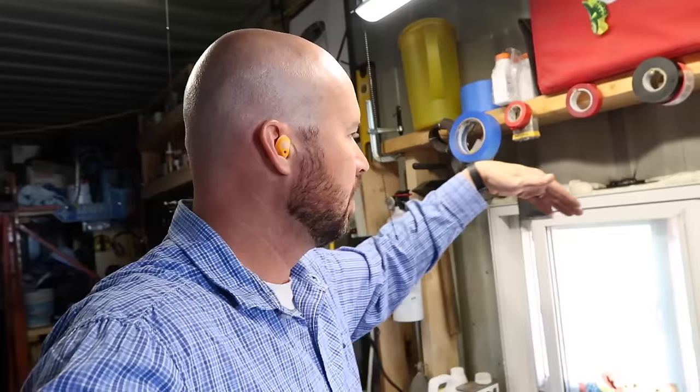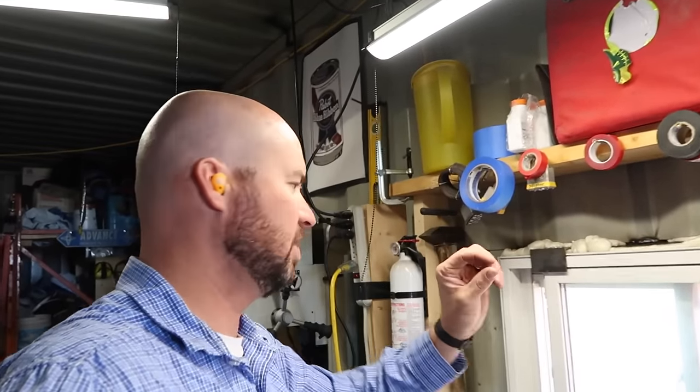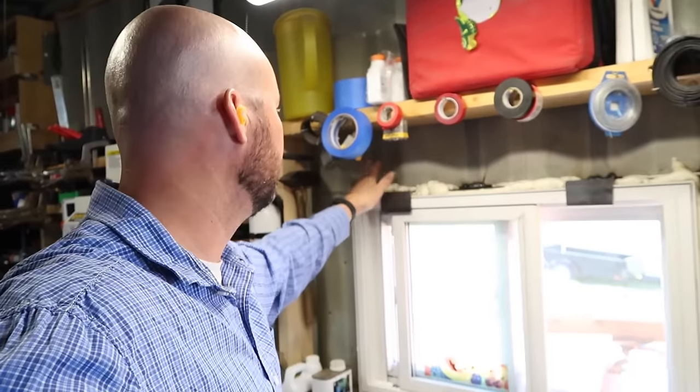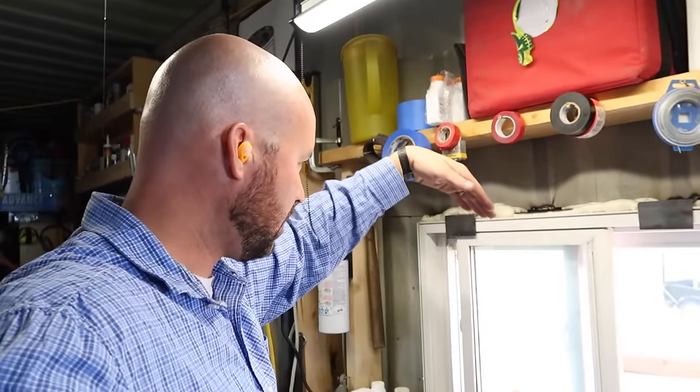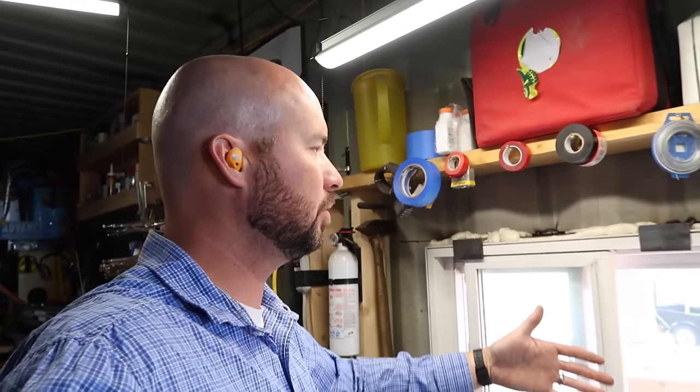a couple of, I don't know, a little metal awning. I've got some pieces of sheet metal, maybe 1/16 thick, that I'm gonna cut. I'm gonna notch it to match the profile of the ridges of the sea can. And I'm actually gonna mount it like this. That way we can shed as much water as possible.